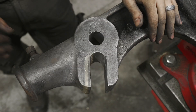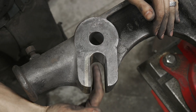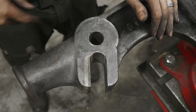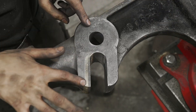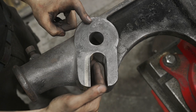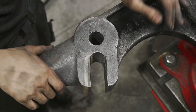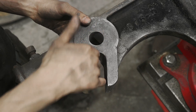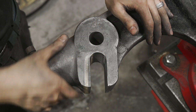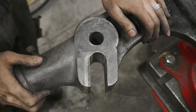I'm super happy with how that braze turned out — it looked really, really nice once we got it all cleaned up. This is nice and parallel, nice and flat. Our pin should fit in there real nice with a little bit of clearance on both sides, and our braze turned out really good. You can see a real nice line down the front and in the crack, and our radius turned out real nice. Overall that turned out better than I expected. The only issue we really had was that end mill was way too much for the Bridgeport being two-flute — not ideal — but we knew that was going to happen. Really happy with how this turned out and we can continue on working on this piece.